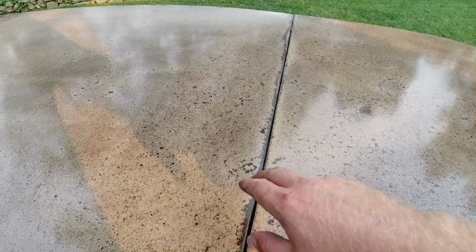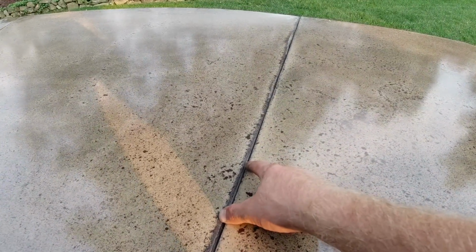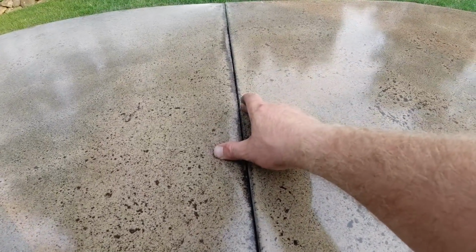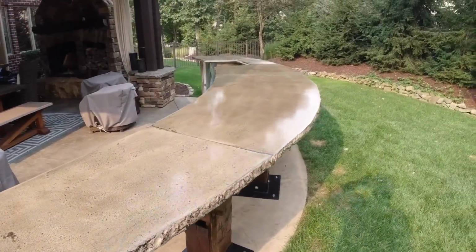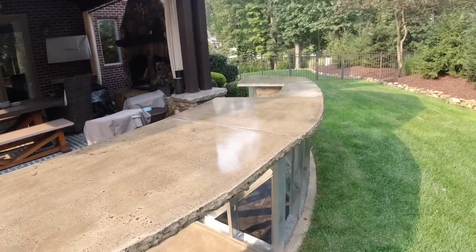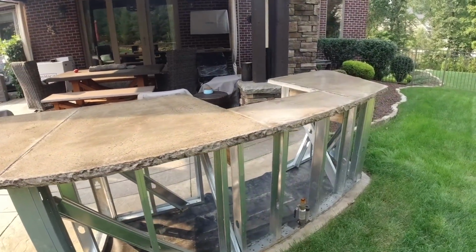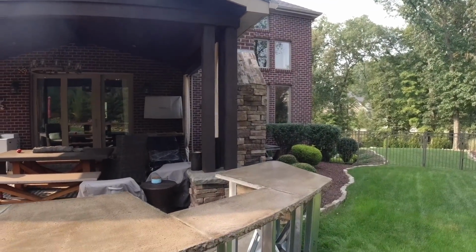Then we have our seams. We're going to get our epoxy and mix up some harvest wheat, some black, and some red with black. Tape these off, mix it in, get it to blend in real nice, and then this one will be done. Just wanted to show you that. And then these all get stoned under there. Probably to match the chimney, I would guess.